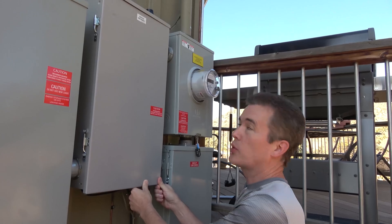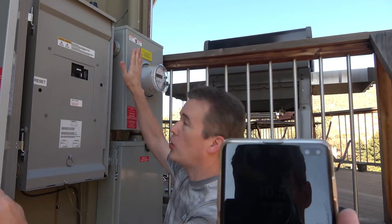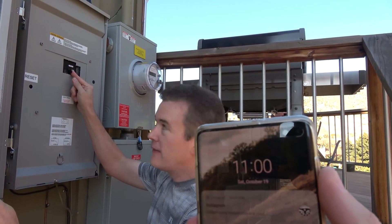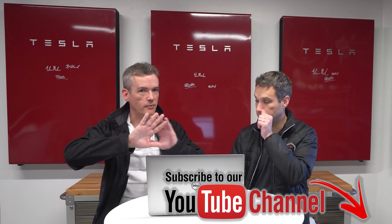One of the first questions was from people who had concerns that we were somehow not allowed to be off the grid or that we were putting electrical linemen in danger. We wanted to point out there was no danger at any time and we're totally allowed to do this. All we did was flip the main breaker on our house, which disconnected our house from the grid. Since we have the power walls installed with the gateway, it automatically islands our house and keeps our solar system, power walls, and household separated from the grid. So when that breaker is flipped, there's no way that anything goes back — we weren't cutting any wires or anything like that. You just flip a breaker. It's super easy.